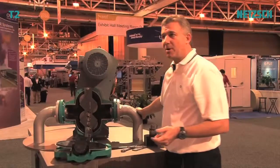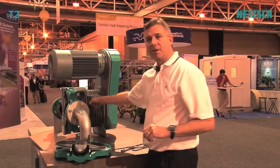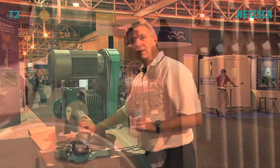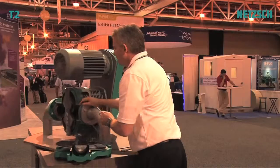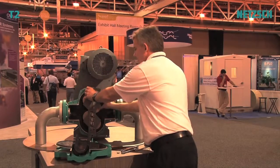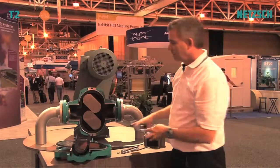This is the first pump where the setting of the rotors is done on the outside — outside of the process — where you have a tensioning device. All you have is four screws, four bolts. You tighten those up, remove the setting device, and your rotors are timed. Then put on the front cover.